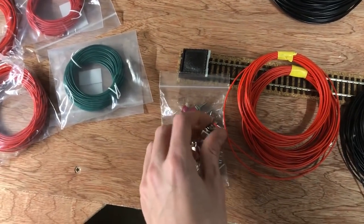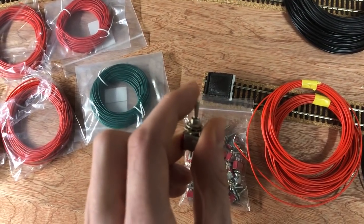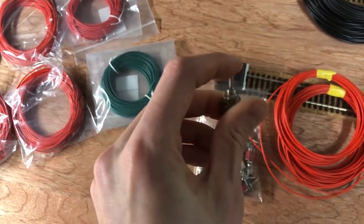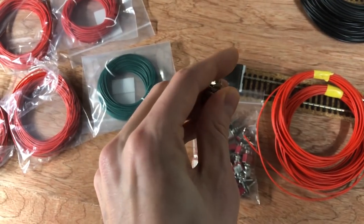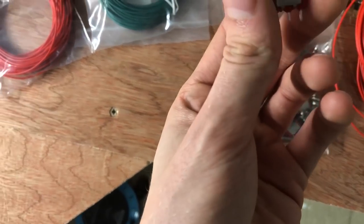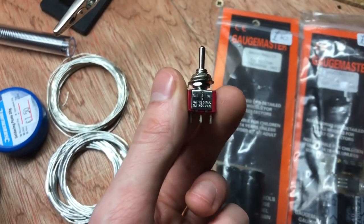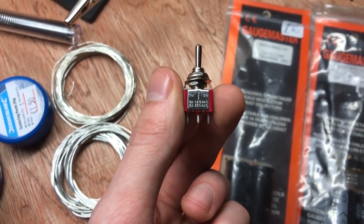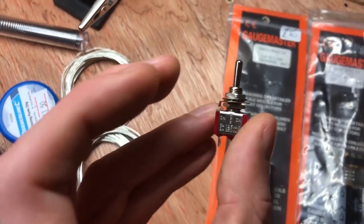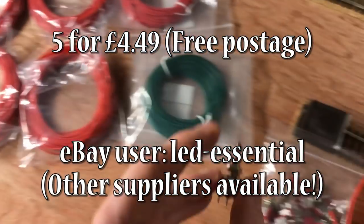You're going to need some switches, and these are momentary switches. The centre is off and you flick them one way, and they will release back to the centre. So they're momentary on and off and they go both ways. I picked these up on eBay for about 80p each. I'll bring it under the light so you can see it on the back — it's on, off, on. I don't know if it's got a part number. If I can remember where I got them from, I'll put a link, but you can pick these up almost anywhere.